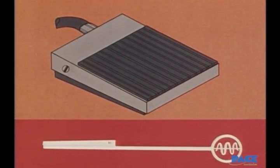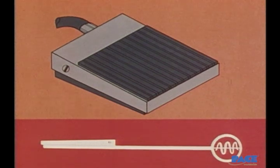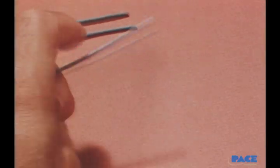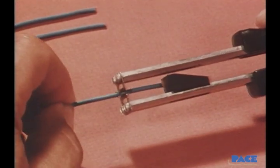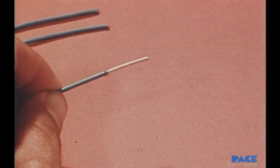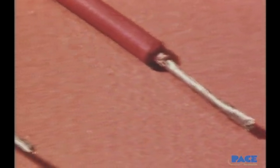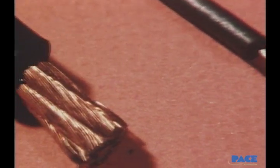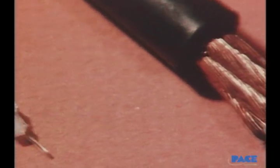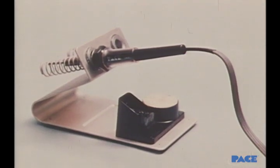When the foot switch is depressed, power goes to the tips, heating them instantly. When the switch is released, they rapidly cool, giving the operator precise control over when the heat starts and how long it stays on. The wire is inserted and held lightly, and the foot switch is depressed to melt the insulation. The tool or wire is rotated as penetration occurs. The thermal stripper reduces the chances of nicking the wire and safely removes all common types of insulation, including shielded cable.